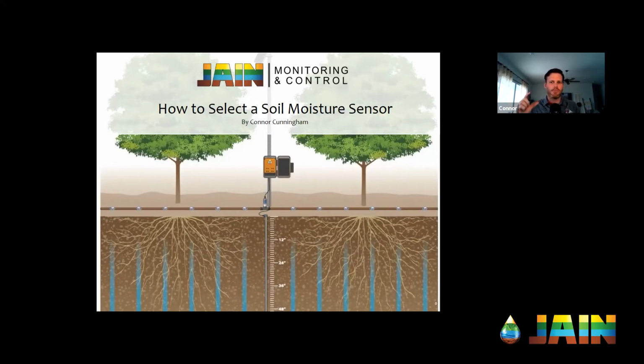And that's what it is. It really is some gypsum inside of a steel mesh, and it uses solid state electronics, functioning off the basic physics of electrical resistance between the soil probe and the actual water in the soil. So you bury these? Yeah. Just like the tensiometer, you're going to auger a hole in the soil and put this down inside the hole. You want to wet the hole a little bit, and then you deploy that sensor down in the soil. Then you'll have some wires sticking out of the ground.